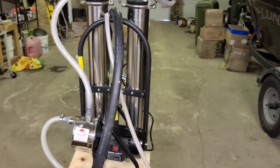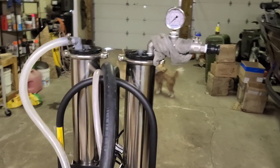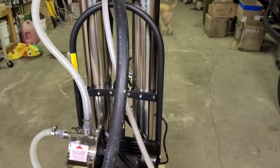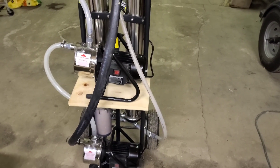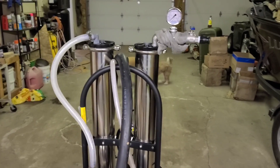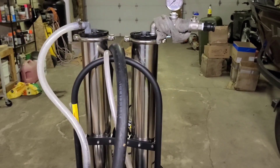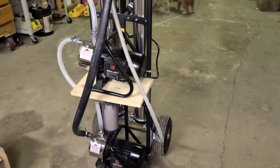I have run it a total of five days. I've pulled close to 3,000 gallons of water out of the sap — out of approximately 6,000 to 6,500 gallons of sap. So I've taken half the water out, saved over 30 hours of cooking and 30 hours of burning wood. And when you burn five wheelbarrow fulls every hour, that adds up pretty quick.